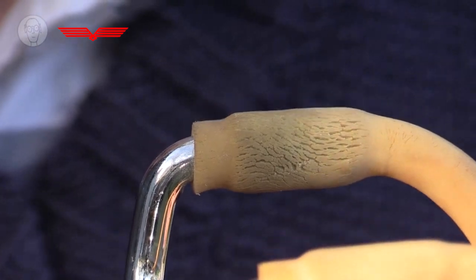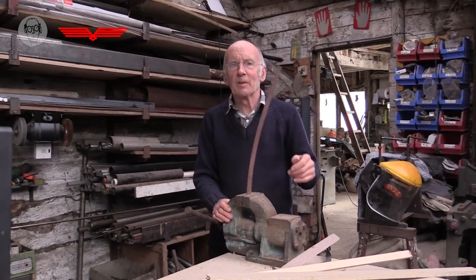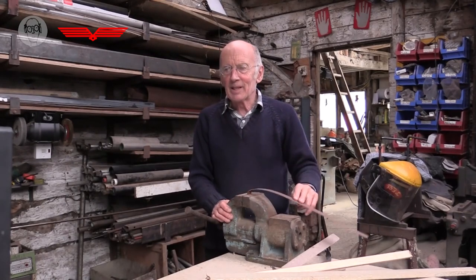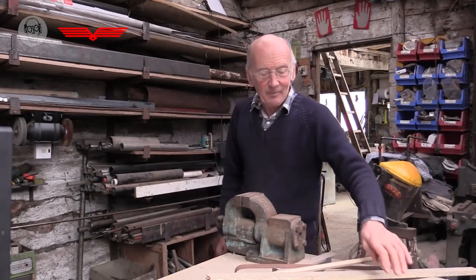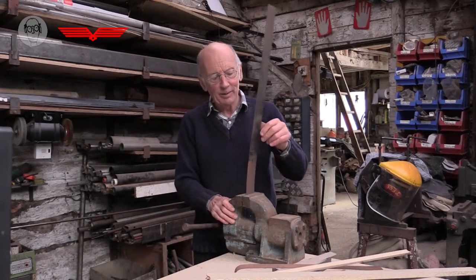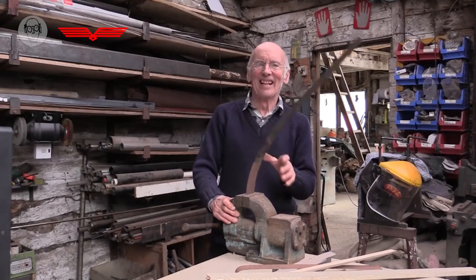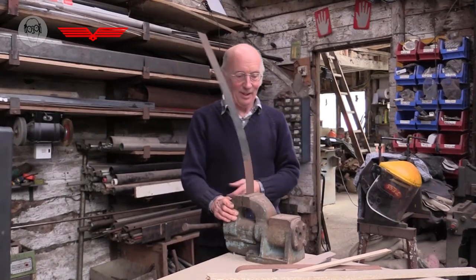But really today, most springs are made of steel. Well, this is just a bit of mild steel. And yes, it looks springy, but it's not really that much better than the aluminium. It very easily just deforms permanently, called plastic deformation. So spring steel, made for springs, is a sort of alloy. There's a little bit of carbon and quite often a bit of manganese added as well. So this is spring steel. And it does go back to almost exactly where it started from.